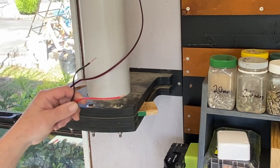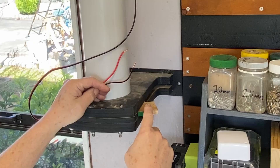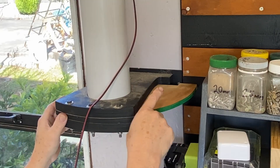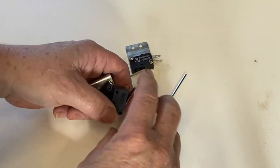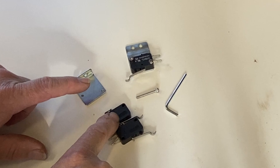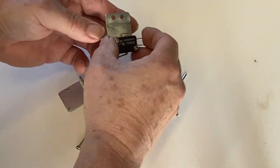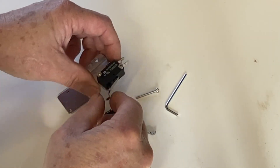Here's the plan. The wires at the blast gates will be connected to a micro switch which will be mounted there, and then there'll be a bracket on the slider that'll interact with that micro switch, so when the slider moves the dust extractor will turn on. I have three micro switches here — I only need two at the moment — and they come with two brackets. The bracket is an L bracket and what I've done on this other one is flatten it out. There are a couple of holes in here that I may be able to use and that will mount onto the blast gate nicely.